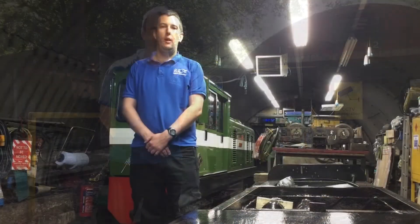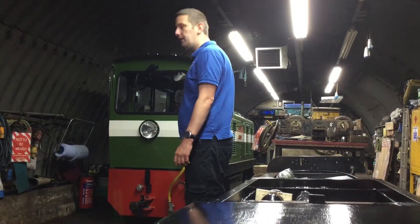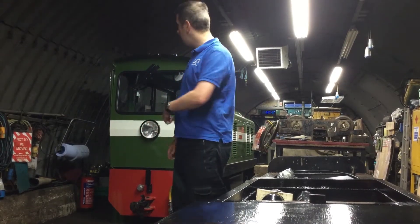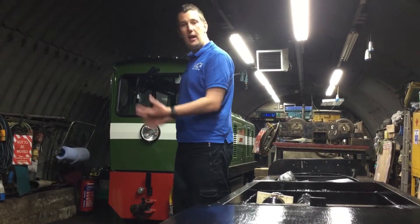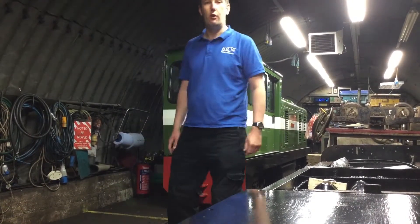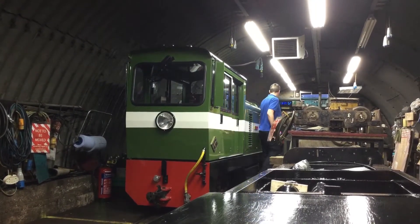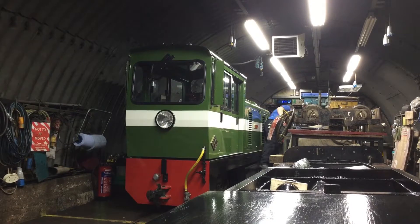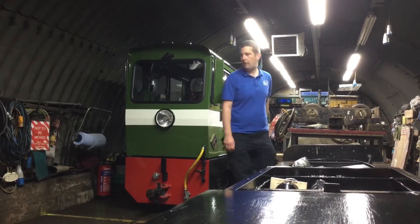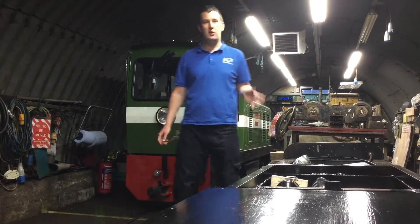So we're in the shed now. Here we've got Rayleigh Bayhurst, which is one of our big diesel locomotives — this is the one I'm going to prepare for service today. The first thing I have to do before I even get it out of the shed is walk around it and make sure there's nothing leaning against it, nothing connected, and none of the 'not to be moved' boards on it front or back. I'll have a quick look around now — all down this side, nothing around the back — it's a bit tight for space in here. Nothing touching, nothing there, so that means I can now start it up and get it out.